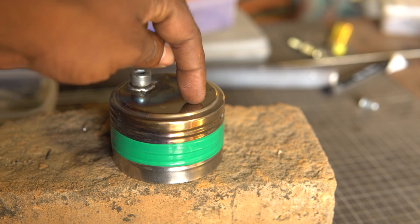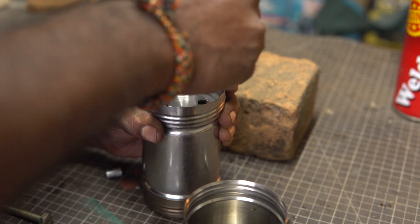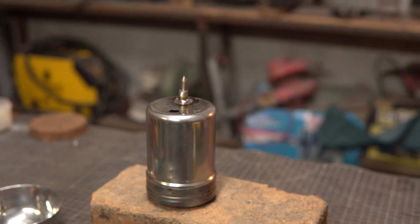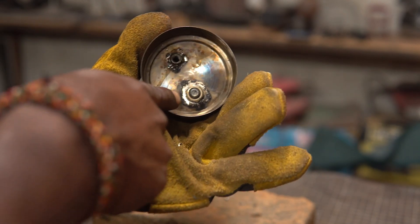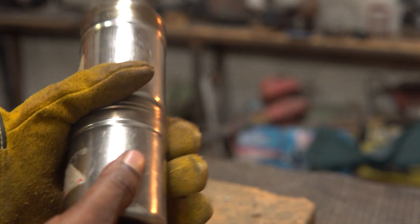The second hole must align with the bottom of the top container and also the lid of the second container. Once I got the holes drilled, I transferred the placement to the bottom of the first container. I cut the thread rod and made a 45-degree cut on one side, which will be the bottom side. I also made another hole which secures the bottom lid to the top container permanently using a bolt and nut. All the gaps were filled using solder to make it leak-proof. The second hole has a rivet nut which will have the thread rod pass through it, all the way through the rivet nut on the top lid.